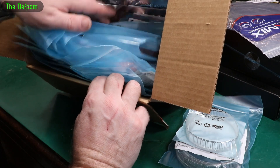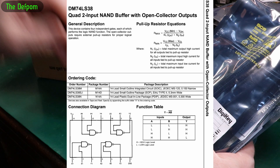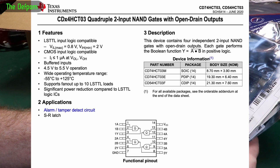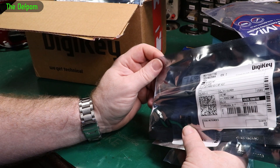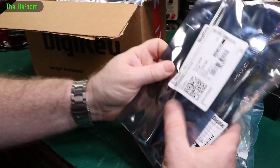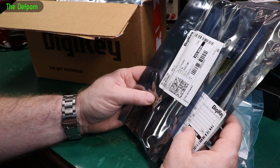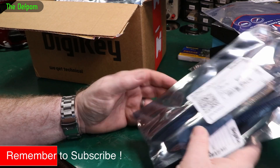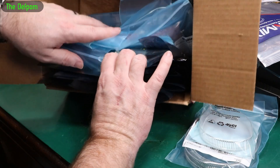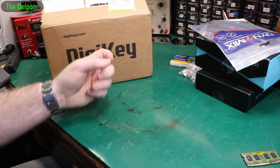Also in here are some ICs: 74LS38N, 74LS02N, 74LS05N, 74HCT03E, 74LS03N — that's the one I really need — and 74LS74AN. These two are replacement parts for an oscilloscope I'm currently working on, an HP 1740A. I'm tracing problems back to digital circuitry and it involves replacing these two chips. A video about that will be out — watch out for that. Mostly though, it's capacitors in this $400 box.